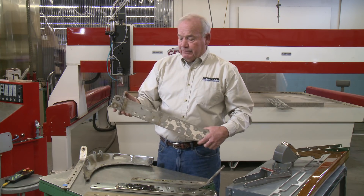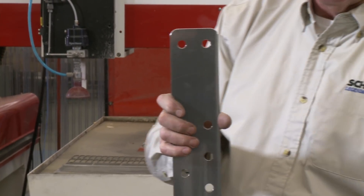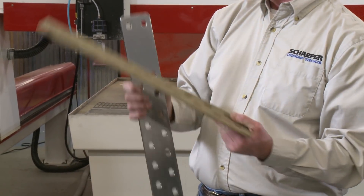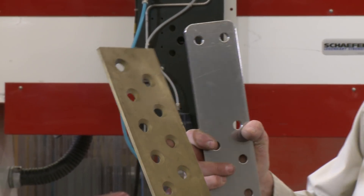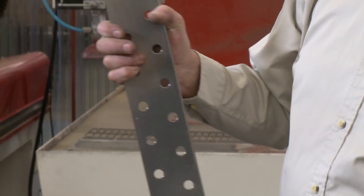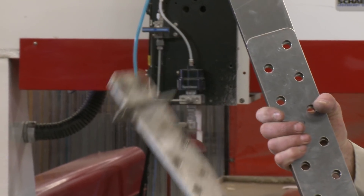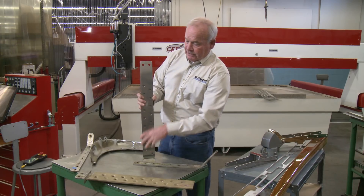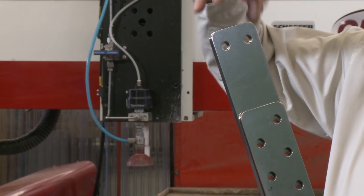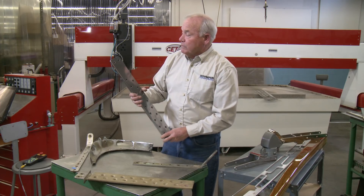So we're going to replace the chain plates with a heavier chain plate in 3/8" material instead of quarter inch, and matched that up with a lighter weight backing plate. The old backing plate was a piece of bronze — way overkill, only that thickness for countersunk fasteners. We're going to use headed fasteners and have it match up perfectly with the old chain plate holes so we don't have to drill any new holes in the bulkhead. We also made it about 3/4 of an inch higher so that with the new cover plates there's enough room to unfasten them, lift up, clean out the caulking, and keep it dry — reducing the chance of future corrosion.